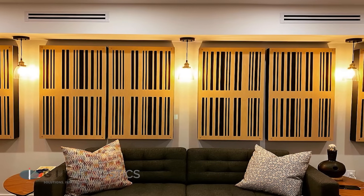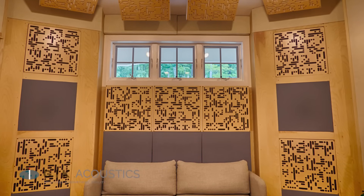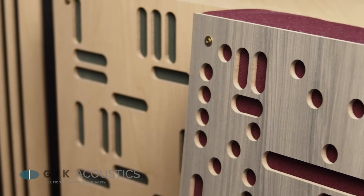The only time when this would not be the case is when your ears are going to be relatively close to the rear wall. It's always best to check each specific type of diffusion panel to see if there is a minimum seating distance required. A very safe choice will always be one of our Alpha series diffusers. Scattering style flat plates like those in the Alpha series have a much closer distance tolerance than the depth-based diffusion in our Gotham or Grid fuser. As an added bonus, thicker versions of the Alpha are also deploying more bass trapping behind the scattering plate, so you're getting significantly more value out of the same footprint. Just treating these three areas — first reflections, corners, and back wall — will bring your room's audio quality up dramatically.